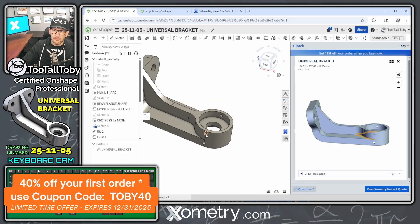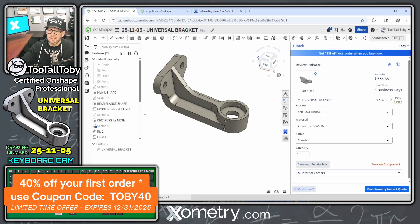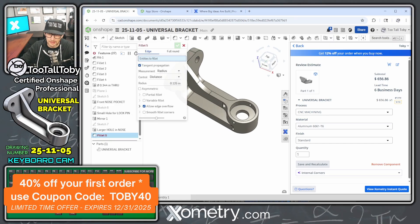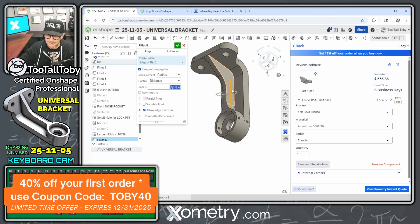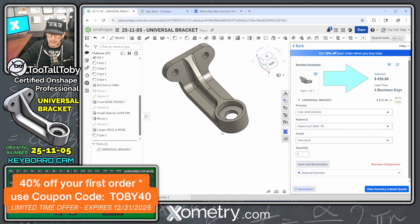With that being the case, it really doesn't matter if I add in a fillet — it's not going to affect the way this part works. The cool thing is because this app works right inside of OnShape, I don't have to restart or resubmit the quote. I can just go into OnShape and add in that fillet. I'll make it about three-sixteenths of an inch, just making sure it stays out of the way of those holes so the bolt head doesn't interfere.